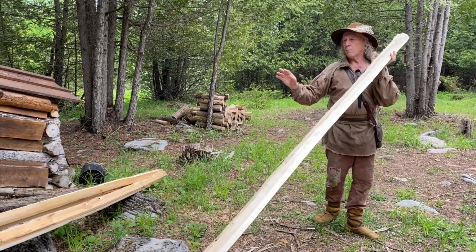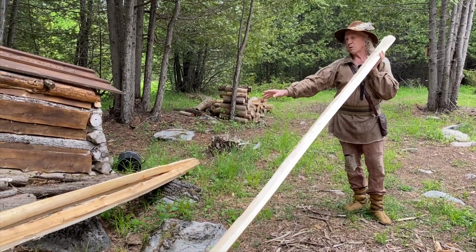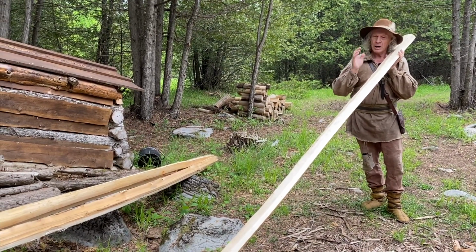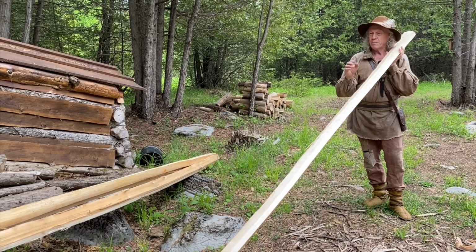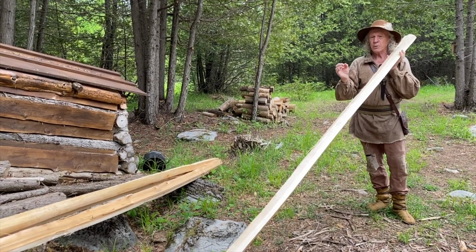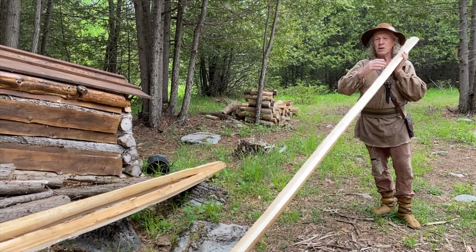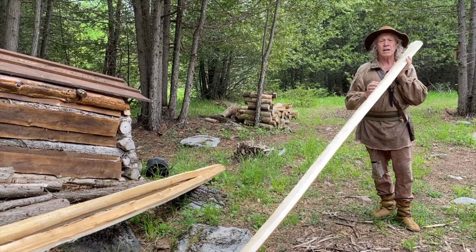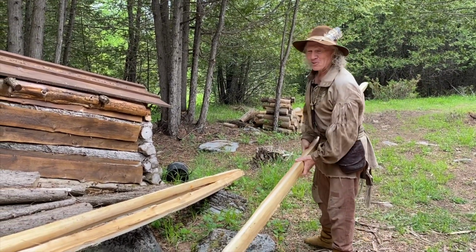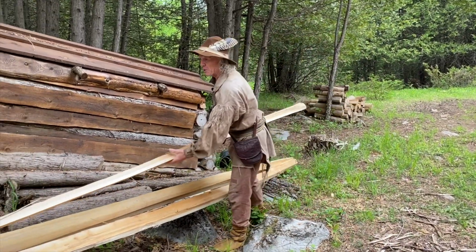So I brought out four. I've got some of the heart that I can possibly use, but these four pieces are going to give me the six pieces I need. Again, I've got to start splitting and work them out, but I need two inner gunnels, roughly an inch square, two outer gunnels, a quarter of an inch by an inch, and then the two gunnel caps that go on after the canoe's all laced. Anyway, I'm really, really tickled pink, as my mother would say, with those pieces. We'll let them dry for a day or two before I get at them.